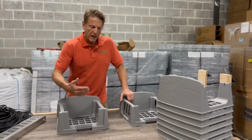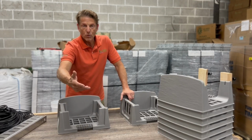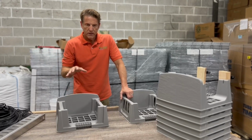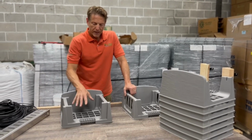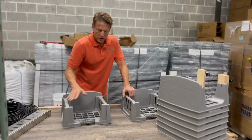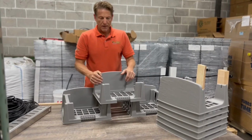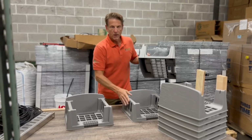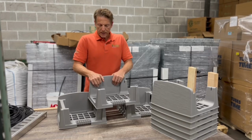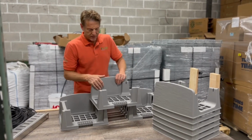So you might have a space behind your wall that is open, and you've got to fill that as well, back to, let's say, your cut for your wall. And so the way to do this sequentially is backfill the face of the wall first, step on it and strike it off so that you can easily set the next course right on top. So you don't want a mound of dirt here that keeps you from setting the next course right on top, okay? So that's what that's going to look like from behind, and I already showed you what it looked like from the face on some of those other shots.